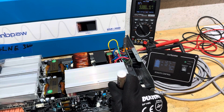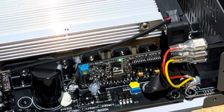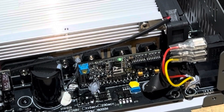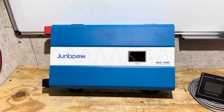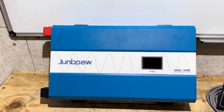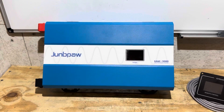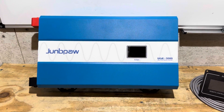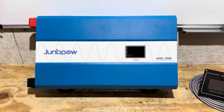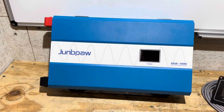So I'm happy with my voltage right there. I can put a little dab of sealant back on this — a lot of times you can use a paint marker and that paint will hold it. So I'm just going to hit it with a drop of paint marker that should secure it and once it dries, keep it from moving. So that about wraps up today's video. I got the inverter all buttoned back up now, ready to be put into service. So please check back soon to see how I'll be utilizing this 12 volt, 3000 watt inverter. Hope y'all enjoyed the video today. As always, thank you for watching. Y'all take care, be safe, I'll see you on the next one.